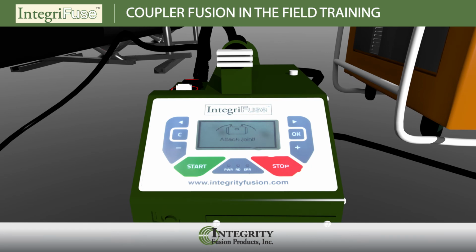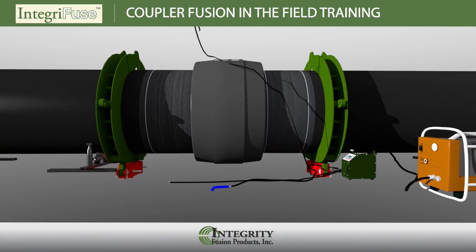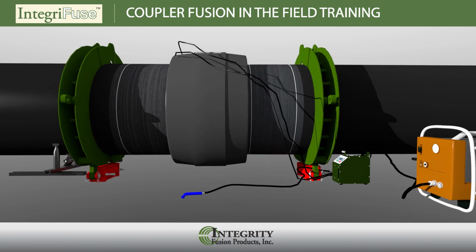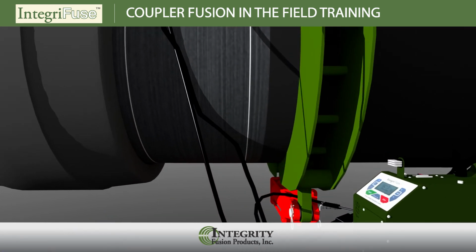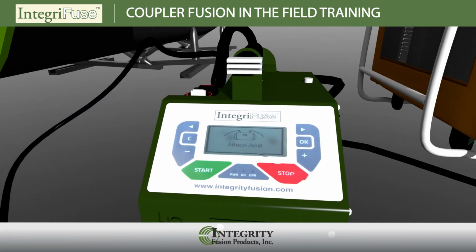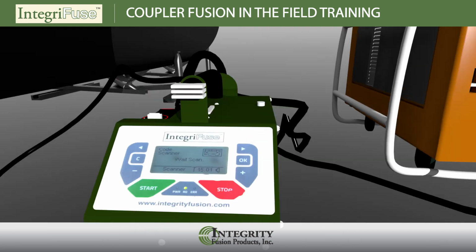When prompted, connect the processor leads to the IntegraFuse coupler, making sure that both connections are tight and secure. Failure to do so can result in unwanted arcing at the loose connection and result in an interrupted fusion cycle and potentially blown fuses in the processor. At the prompt, scan the barcode.